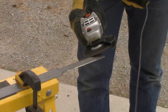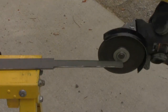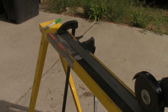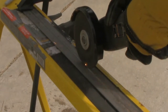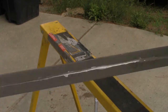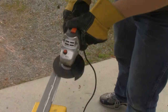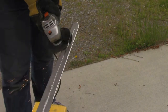The grinding wheel is used to smooth out the edges and any rough cuts that you may have on the sword. It's important to watch and make sure that you get all the edges nice and smooth — you don't want any sharp, saw-like edges on the blade when you're finished. Now, using a form of straight edge, it's time to trace a fuller on the blade. Using the grinding wheel, carefully go down the line that you draw and be careful not to cut too deep, but just put in a simple groove. After that's finished, it's time to grind down the edges of the sword and make them round, keeping all edges nice and round with no sharp spots or square pieces that could potentially cut someone.